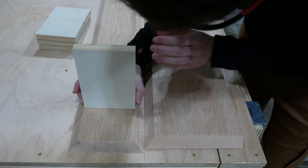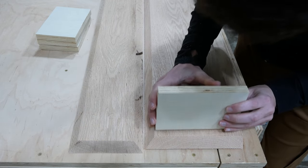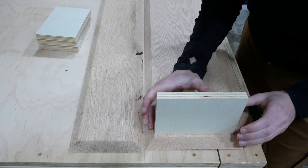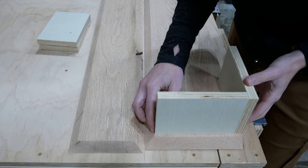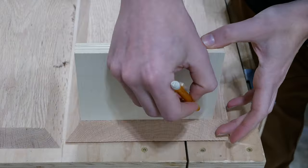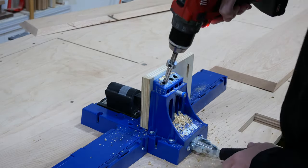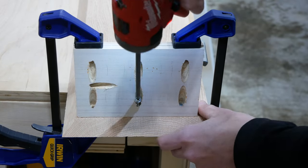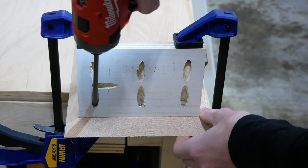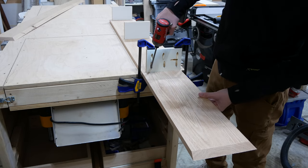I cut 4 rectangular pieces for the frame of the beam that are equal to the width of the flat side on the inside of the front board and 3 quarters inch shorter than the length of the flat side of the inside of the top and bottom pieces. I marked the locations for the pocket holes on the frame pieces and drilled them using my pocket hole jig. Then I clamped and screwed the frame pieces to the inside of the bottom board, spacing them evenly across and aligning the end pieces with the edges of the bevel cuts.